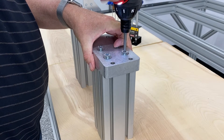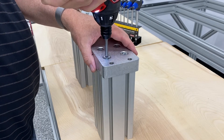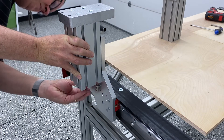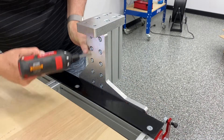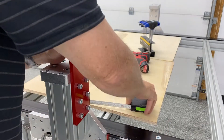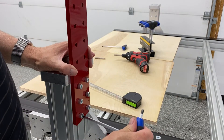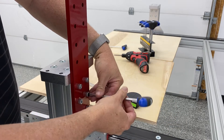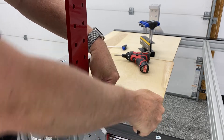Here I'm putting the riser plate on top of the riser extrusion — that's what the actual gantry is going to sit on. Sliding it onto those T-nuts, get underneath with your fingers and flip those bottom two up around the other side so they're not visible from the bottom, then tighten them up. The next step is attaching the plates that connect the gantry risers to the gantry itself. If you notice, there are six bolt holes in the lower portion and eight holes in the upper portion — just make sure you orient this plate correctly when you install it onto the riser.